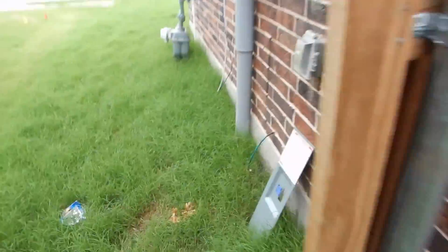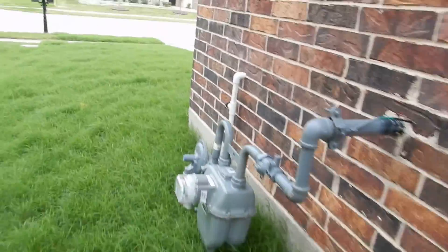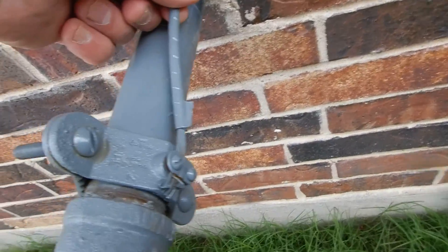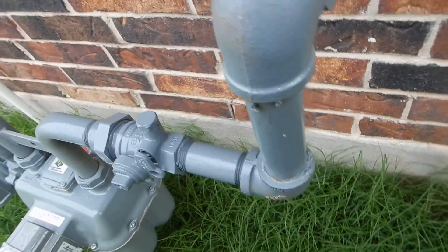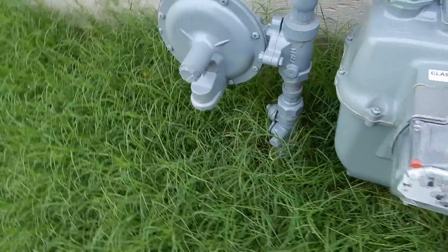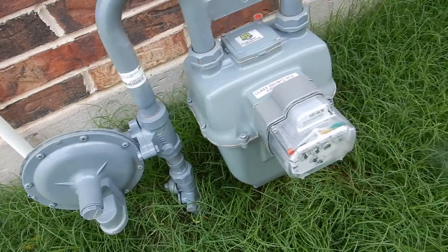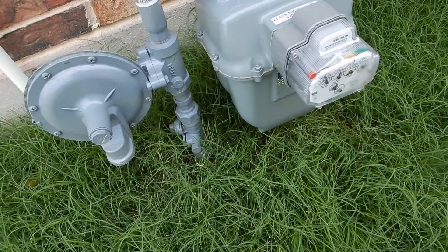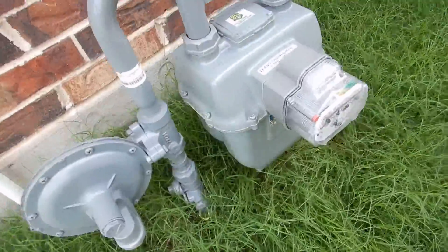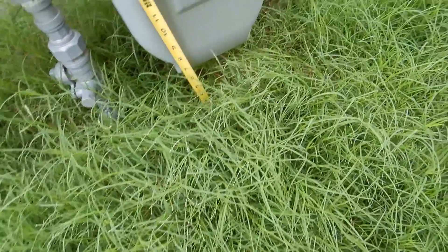The tapping is higher than six inches along the west wall. As we continue through here, this is the gas meter, and that's the bonding for the gas meter — that's a good thing. This pipe is not supposed to be closer to the ground than six inches. Going over here, we've got it at six inches — okay.